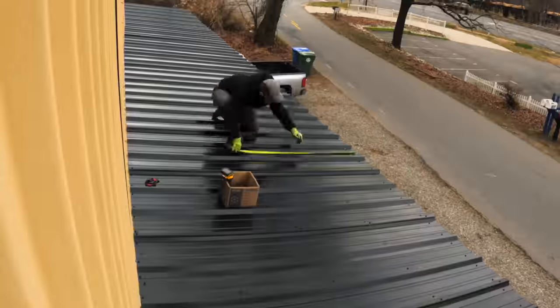I used a level to get the gable trim aligned with the roof panels, then tacked it in place with one screw at the back and front of the trim so I could mark where I needed to cut the other end. I marked a line flush with the roof panel on the top of the trim and a plumb line on the side. I removed it, set it on sawhorses, and cut it to length, leaving a 1-inch wide flap on the top front edge that I folded down with my hand seamers. I also cleaned up my cuts and used a black marker to touch up any scratches.